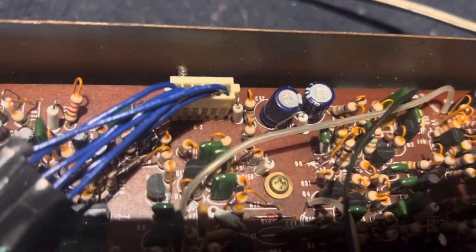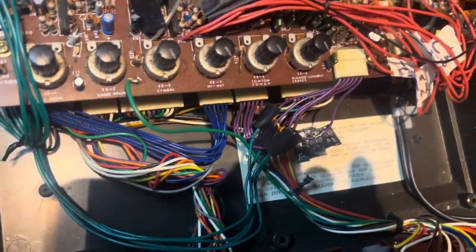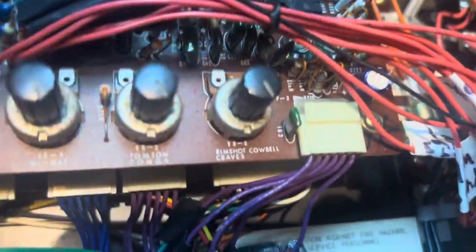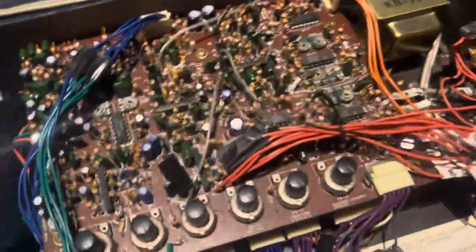You can see that's labeled H2. The other ones — all the green cables are mine going into my little breakout box. I interrupted the purple connector right there, next to capacitor 91 and next to the rimshot and clave's volume pot. I also did individual audio outputs.